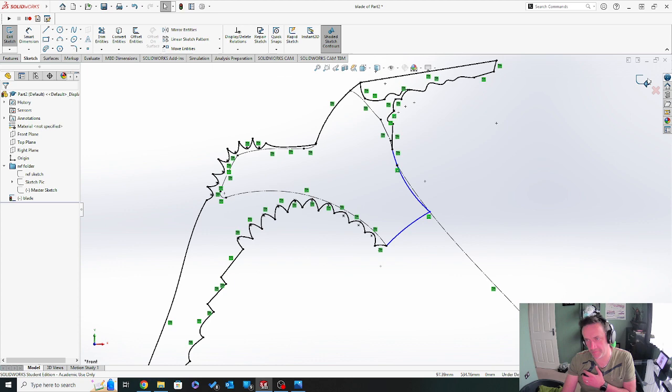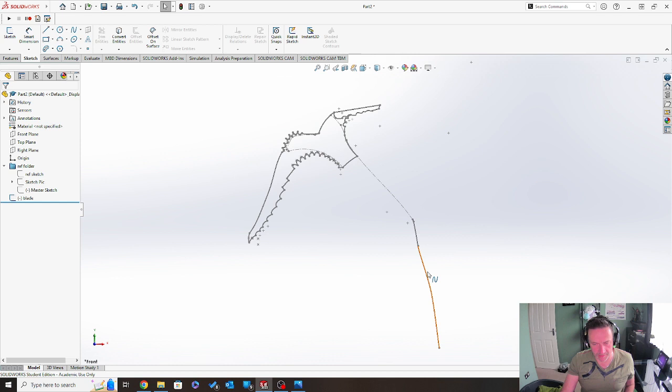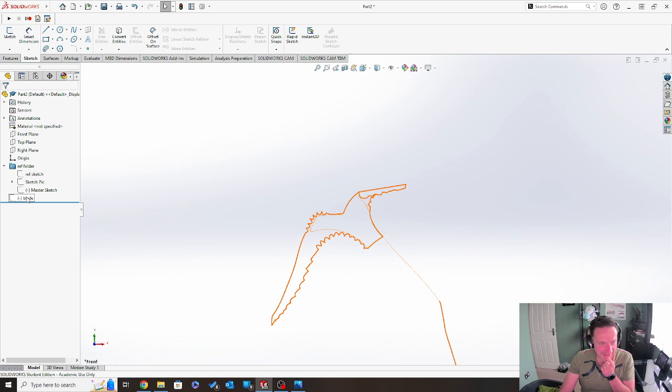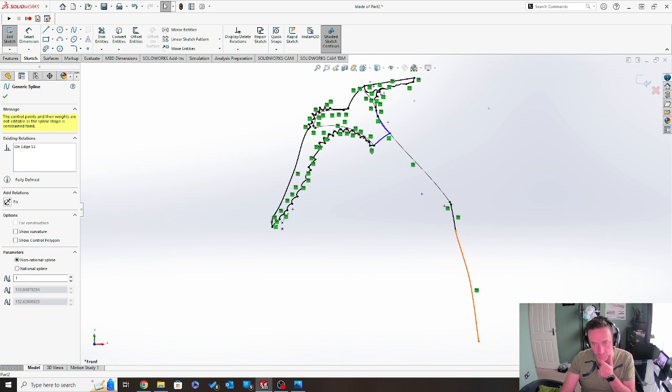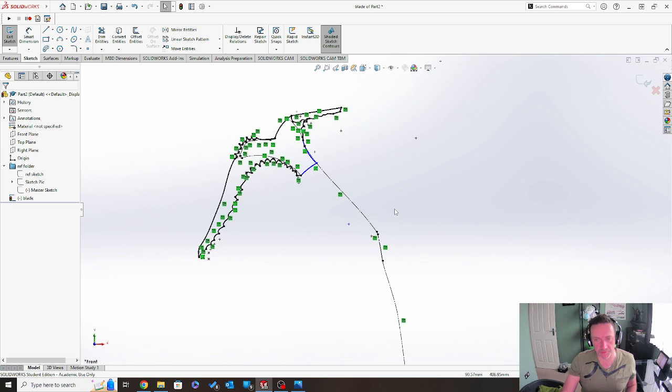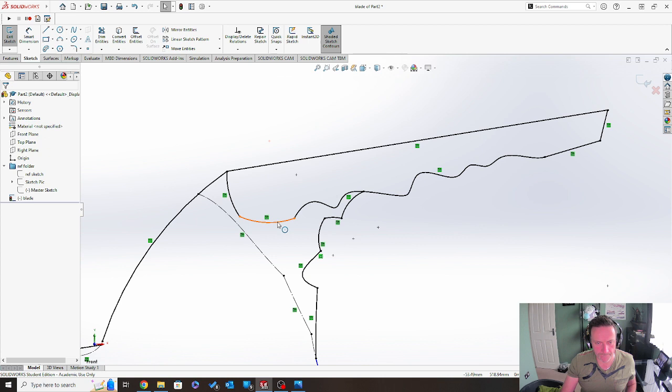And whoops, you see this down here. Now, when we're about to move into a sketch and into the actual parts in a moment, that's going to cause problems. So what we need to do is come back and make sure that whatever is construction is not going to be part of what we're doing. So let's go here. Let's go to here. And I'm just converting them from a solid geometry line to construction. Or else the system's going to go, no, what are you doing? Don't be silly. I'm going to go you to there. And I'm going to turn that into construction.